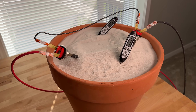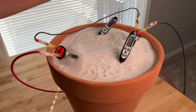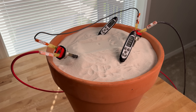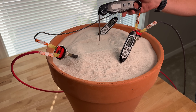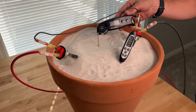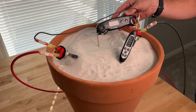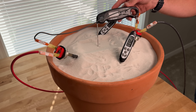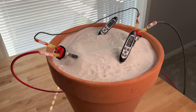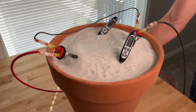The first hour is in the books. I'll keep these two temperature probes in the same spot for the whole test. The front probe is at 111°F and the back one is 135°F. Now that's obviously warming up, but you might think that's not that impressive. So if we take the probe and go a little deeper — closer to those heating elements — we are way hotter down in the sand. We are at 350 degrees Fahrenheit, even after just one hour. It'll be really interesting to see what the whole volume of sand gets to after three or four hours of continuous solar.